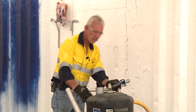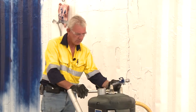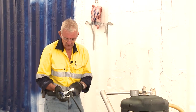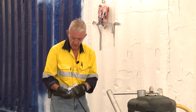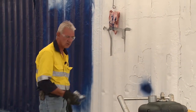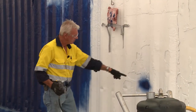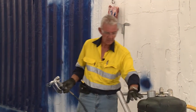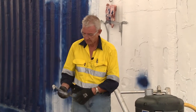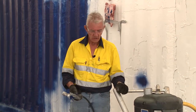But what do you think might still be a consequence of what we've just done? The air motor's stopped — but remember what I said about the airless line. Because the pump's stopped and stalled out, it doesn't mean that the pressure's gone out of the line. The pressure is still in this gun. I've stopped the air motor, but I could have accidentally shot myself like we did with the meat. So remember: if the air motor is stopped, it doesn't mean the fluid pump doesn't have any pressure. With the safety on, I need to evacuate the pressure out of the line.